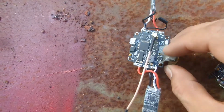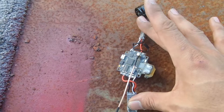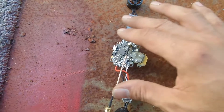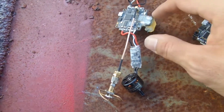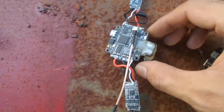And then another crash, and all of a sudden motor outputs 1 and 4 aren't working. It powers on, beeps and makes the tones, but going to the motors tab, they won't power up. Only 1 and 4 — 2 and 3 are fine. So that's kind of strange.